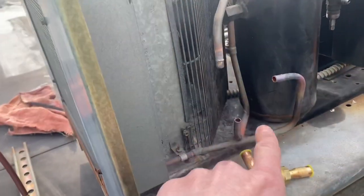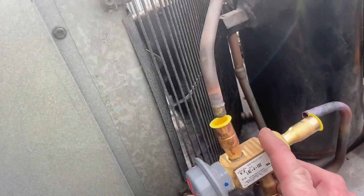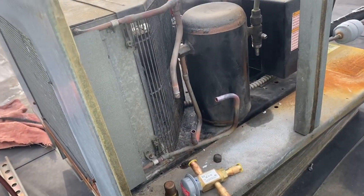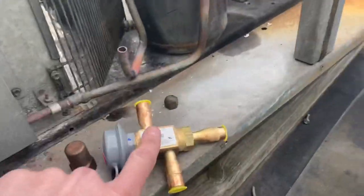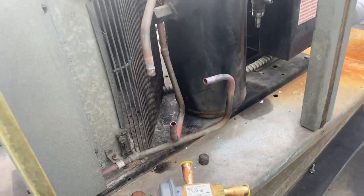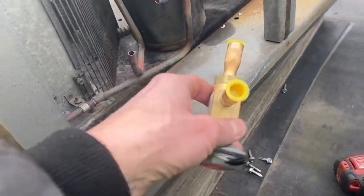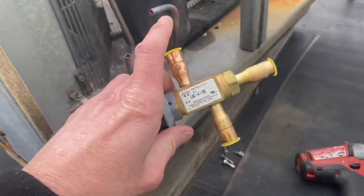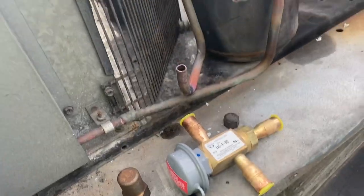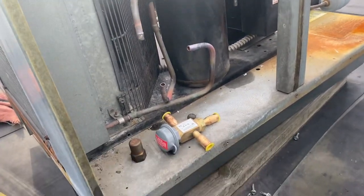And C is going to be going to this line coming out of your condenser. I got all the videos on my channel if you look back on headmasters and how they work. But essentially, this is set for 180 PSI. So if it's not maintaining 180 pounds PSI on your high side going through your condenser and into your receiver, this valve will open up and bypass down through here into your valve and then out into your receiver, letting a little discharge gas in to mix with the liquid to keep your pressure up at around 180 PSI. It's just a little sensing bulb here sensing pressure - kind of works like an expansion valve in a way. All it does is maintain head pressure in cold weather conditions.